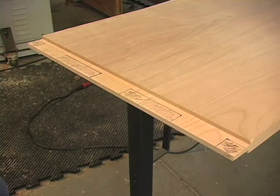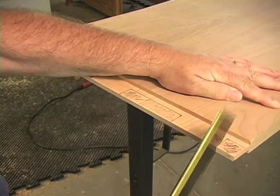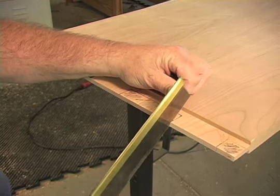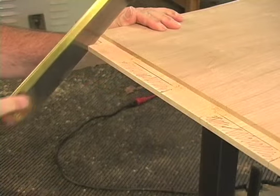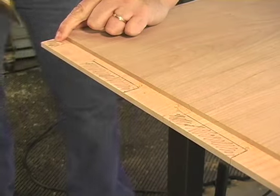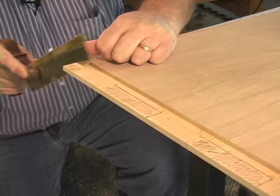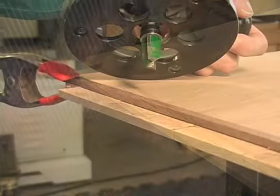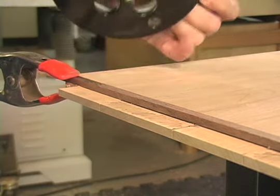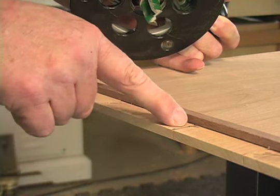The area marked here in black is the area we are going to remove. Because I have access to it, I'm going to remove the two end pieces with my saw. For the next operation, we need to adjust the router bit so the bearing hits on our scrap piece and cuts into our tongue area. The way this is going to work is I'm going to plunge in the cut right here next to the saw cut, travel across until the waste material pops off as my router bit reaches the second cut.